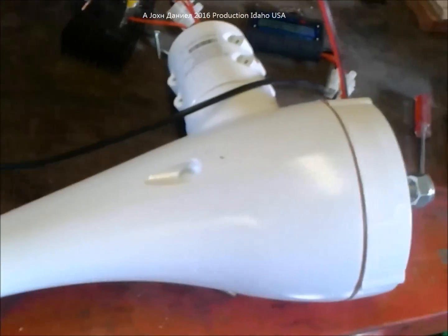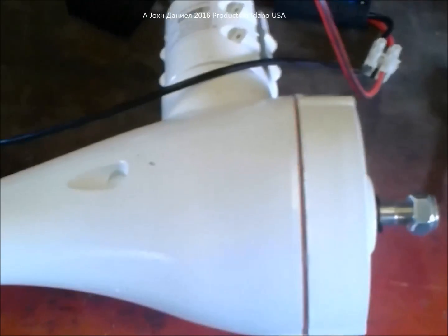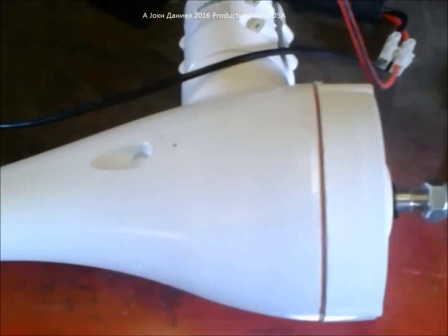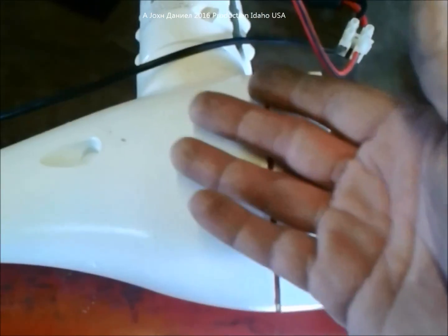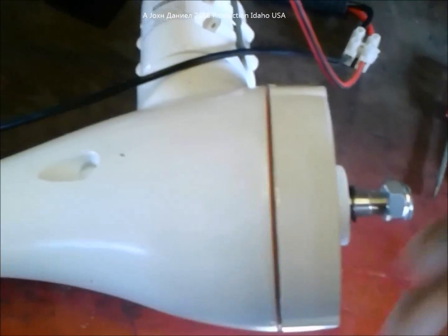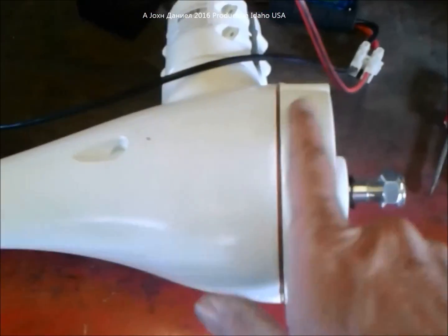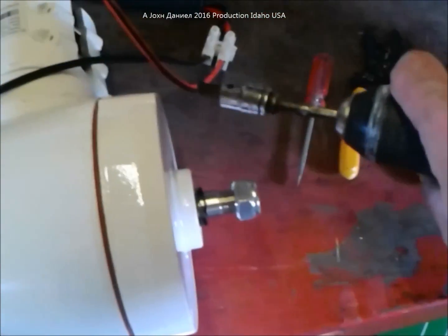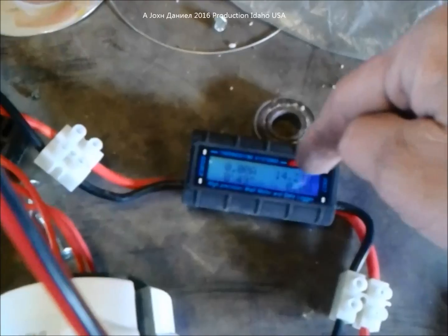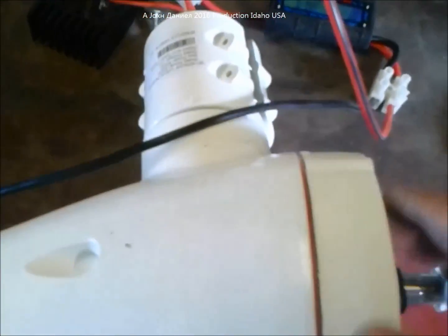If you're buying something with five-foot, 60-inch diameter blades and they're claiming it produces anything over 500 watts, they are flat-out lying to you. I don't care how many blades you put on it — 500 blades — it's still only going to produce the same watts. The surface area or the rotational speed is not going to be sufficient. What matters is circumference of blade so you can provide the torque. You heard this thing bog down — once you exceed battery voltage, you better have big blades.